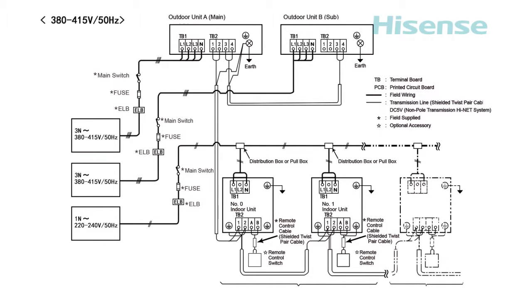For the air-cooled modular unit, we recommend purchasing a power cord dedicated to the single module, with a single circuit breaker and single main distribution line. For the breaker, please refer to the specification listed in the technical manual.